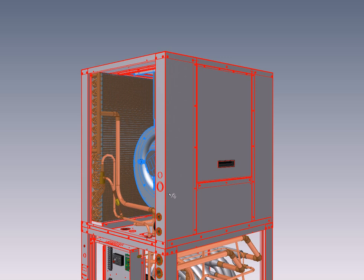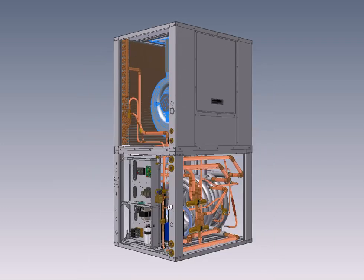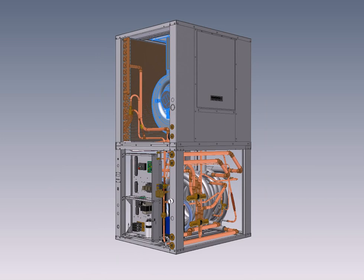There's an electronically commutated blower motor, or ECM, which maintains a constant airflow regardless of duct size or filter condition. This is more efficient than a PSC motor, especially at part load speeds. We're using the latest ECM release from GE or Regal Beloit, called the EON.